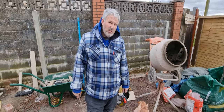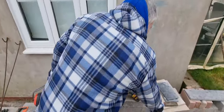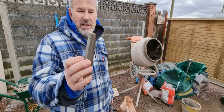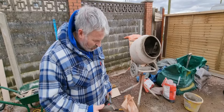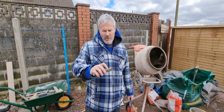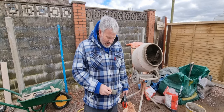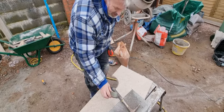We'll show you what it looks like at the end. A little top tip - we didn't have any diamond filing pads, so I've used sandpaper but it's too fine. This is just a carborundum stone - we use this to clean our tools off. I've worn it down a bit, but it's ten a penny. Put it in a bit of water and use it to go around the edge - it does exactly the same job. When you run out of stuff and you haven't got what you need, there's always something in your toolbox to get the job done. If this works out I might even do a little dance.